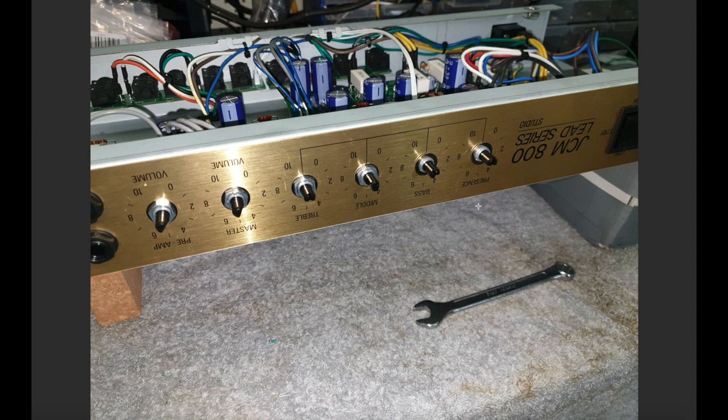Right, so moving on, implementing the José zener clipping diodes is a little bit more difficult, right? So this is kind of, in terms of complexity, the next level up. Certainly achievable, but not as easy as the first set of mods that we just went through. So you need to actually pull, there's a PCB sitting behind these pots here, right? They're all PCB mounted pots. You need to get that PCB out, right?